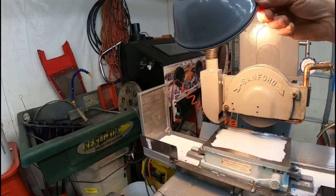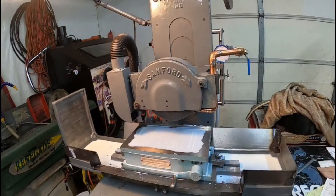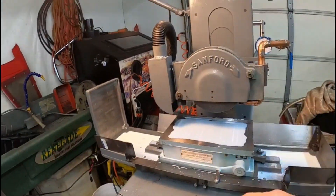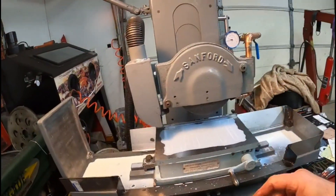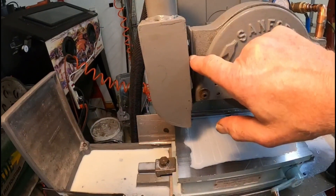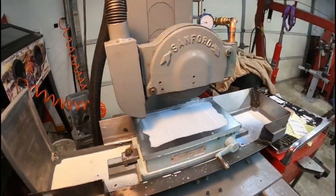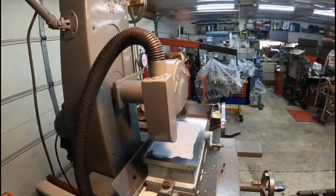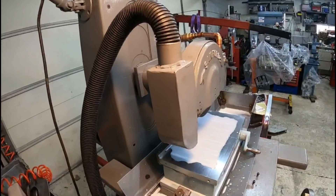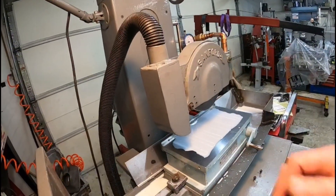The light I can pretty much put wherever I want. This took a little bit of figuring out how I was going to do this. I took a bunch of cardboard, cut it up, taped it together, and kind of mocked it up. It's adjustable — this nut right here goes into this casting here. I slotted this piece of angle iron so I can adjust this up and down, and then it's bolted on the back side here. I'll just put a couple bolts in it on the back side. It's going to be a good functional machine, I think.